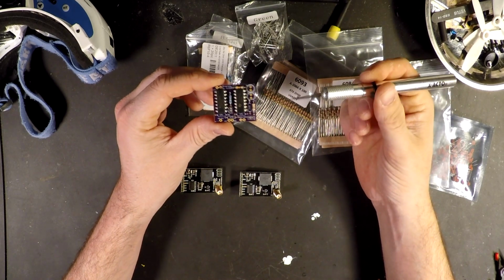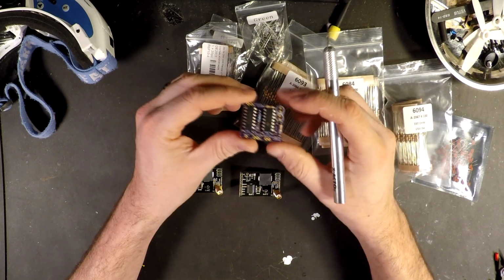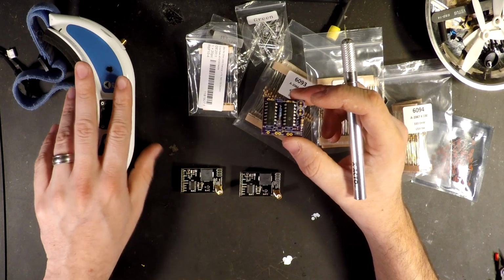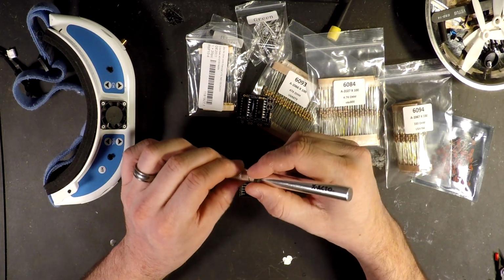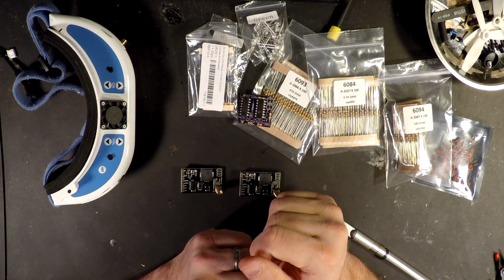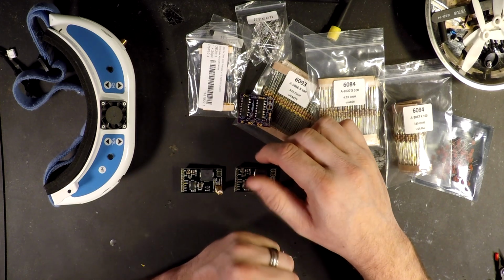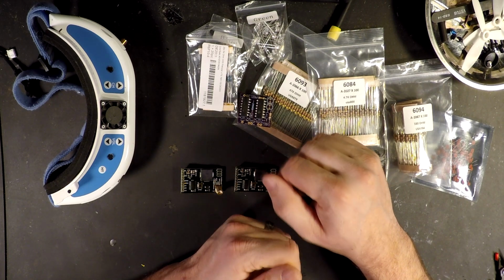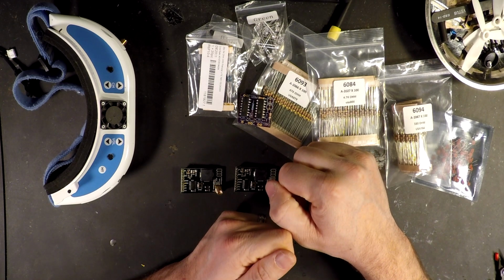Where I had to take time to actually figure out what to do was when I went to open up the goggles. When I went to open the goggles up, there really wasn't anything that I could find that actually broke it down and step-by-step said, you know, do this, do that, solder this here, solder this there. So I had to kind of poke around with it, and I got it, like I said, working when I would provide the voltage to switch the receivers.